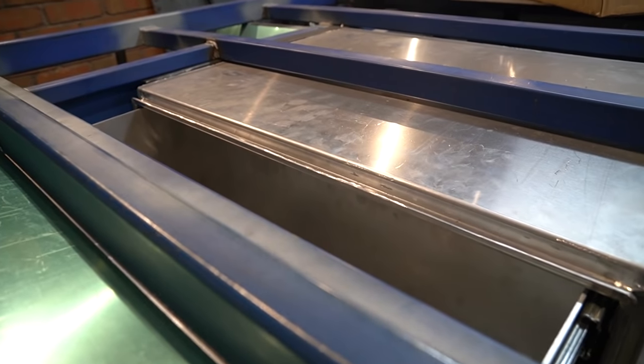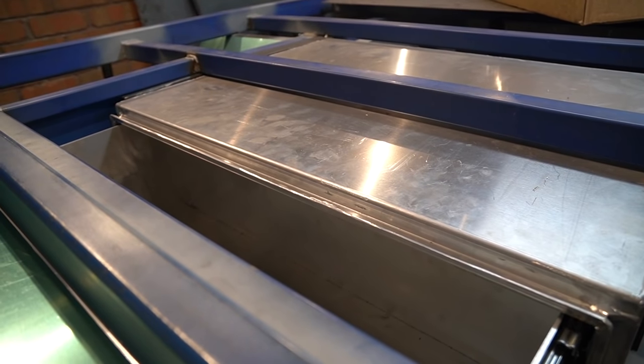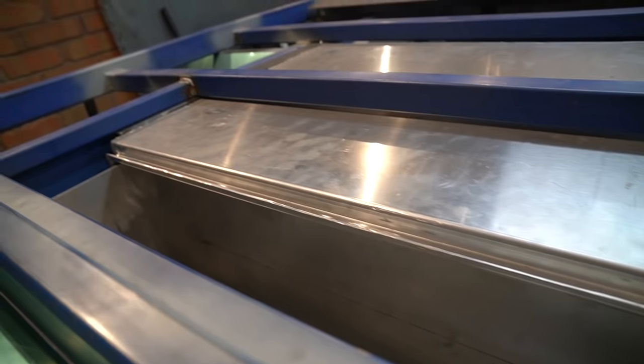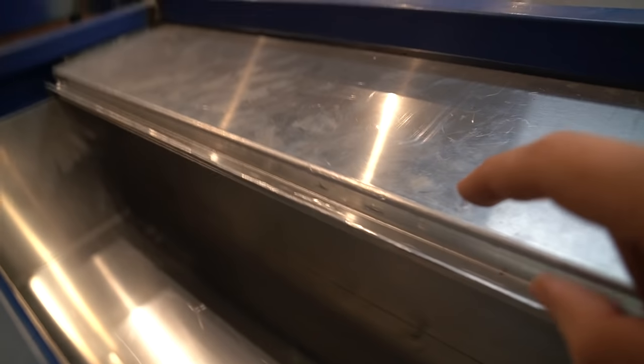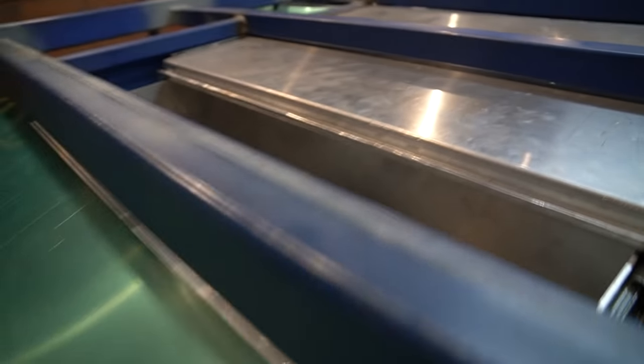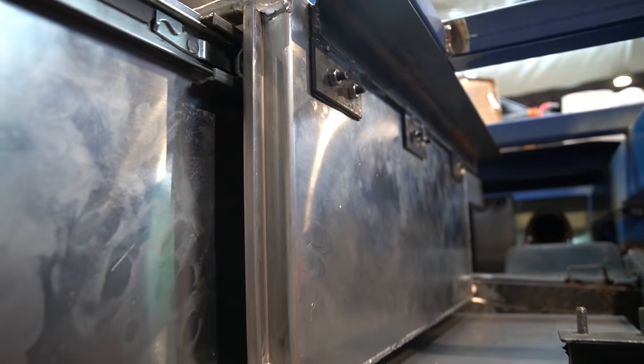Let's talk about something I don't like about the design, and I think it's important to be critical of your own design, so that's why I'm going to point it out. Having the seal return like this, which will create a waterproof seal, actually takes off space on each side, and to me it just feels like wasted space. There's distance between the side of the drawer there and the cowling, so I've got to account for a slider, and then I've also got to account for that seal return, which is about 20 mil, 40 mil each side and top and bottom as well.